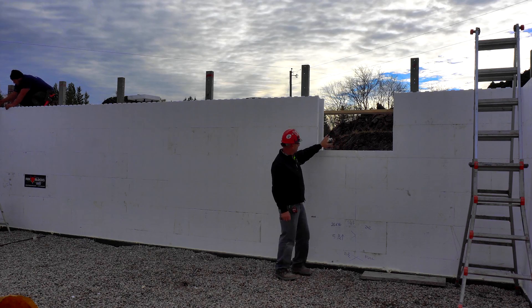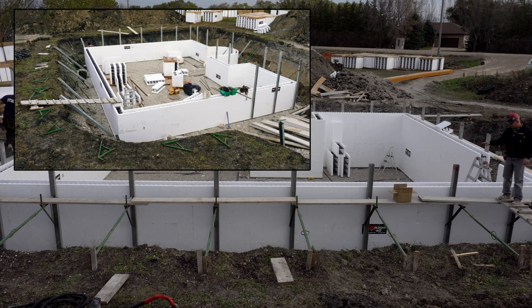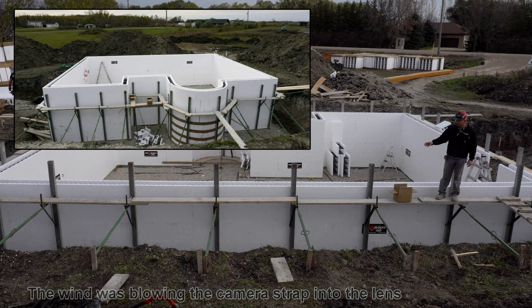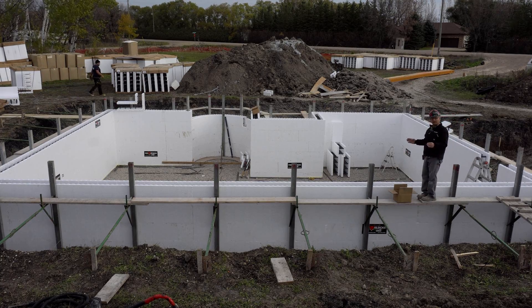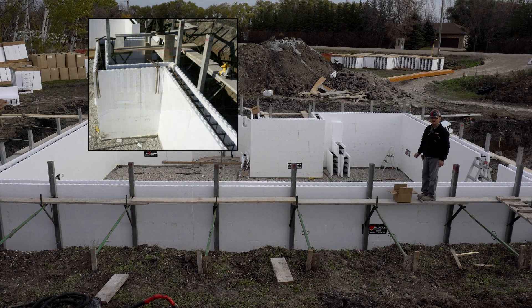We make these cuts and build the whole structure without the buck in place. That way we can put all of our rebar in and make sure everything's right, then we put the fox buck in last. Over here you can see we put the bracing on the outside on this job, because there was over a foot of gravel on the inside and pegging into marble gravel is really difficult for holding power. The bank was close, so we put the feet all the way up onto the bank — that actually helps us get a lot of good lateral movement when we adjust the bracing.